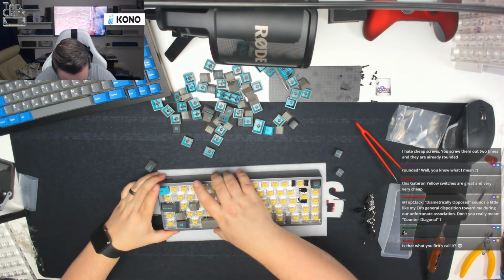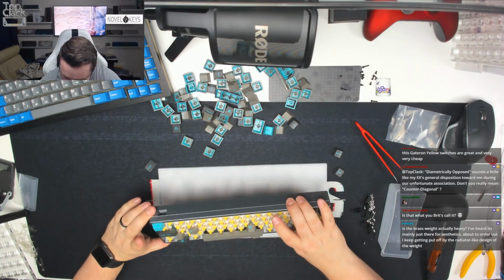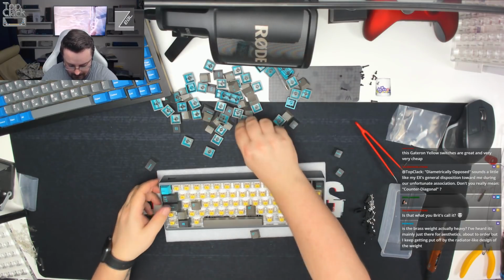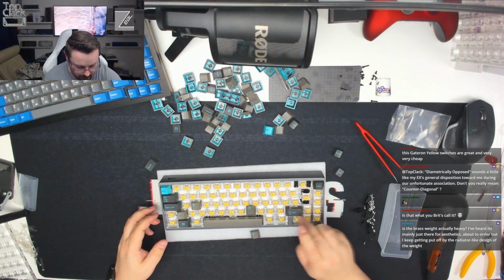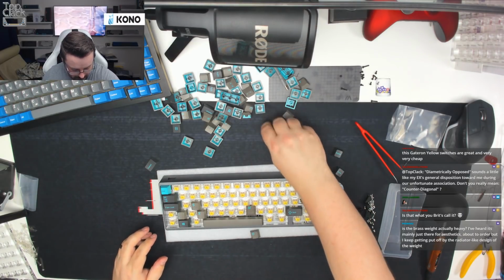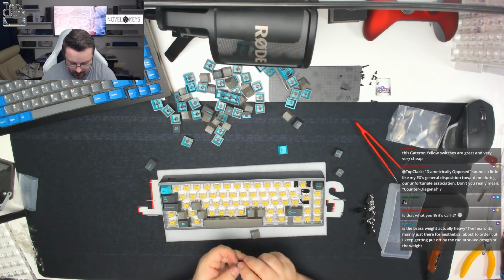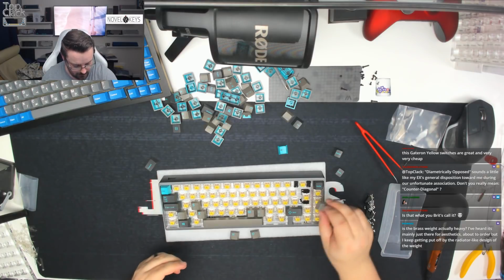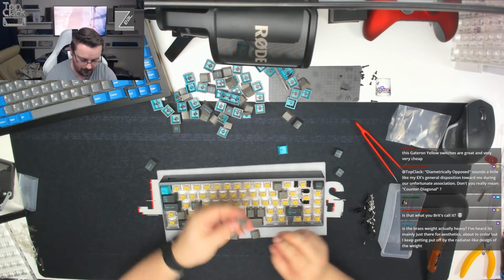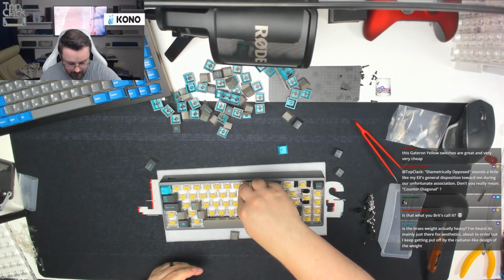It is actually catching on the plates. The keycap's actually catching on the housing there, but it's not on that side. That might be to do with the way the plate's set, so I'll have a look at that in a bit. Tab, we've got the shift key over here, so that's the one next to where the LED is not working. Okay. UIOP, there we go.